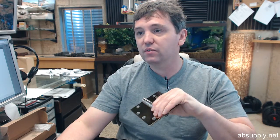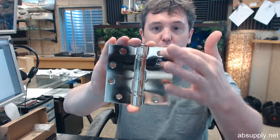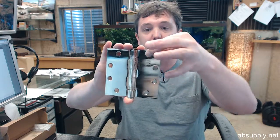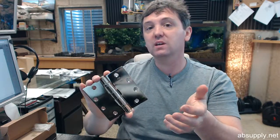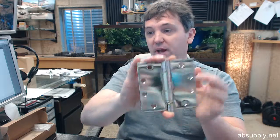There is a link below this video to a document called Cut Sheet. That cut sheet is very handy because it will allow you to review some variations on this hinge. First of all, it's a template showing the important screw locations, and these locations are called template pattern. The document is a template because it's a technical drawing, but the pattern of these holes is referred to by the word template. It is a standardized sort of location for these holes. If you have a hinge that is template pattern, this would be it. Or if you have a door and a frame that would be template pattern, this would be it.